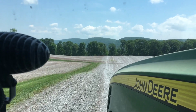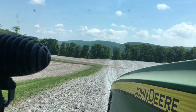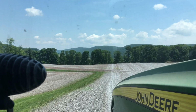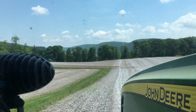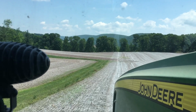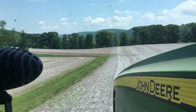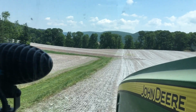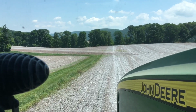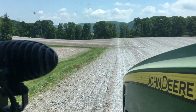We were looking around for clamps, trying to get it clamped, and still no good. What ended up happening was on row 12, that fertilizer that was running down had messed with the sensor, the eye in there to count to make sure the corn is planting, and the computer was basically beeping at us constantly that it wasn't planting.